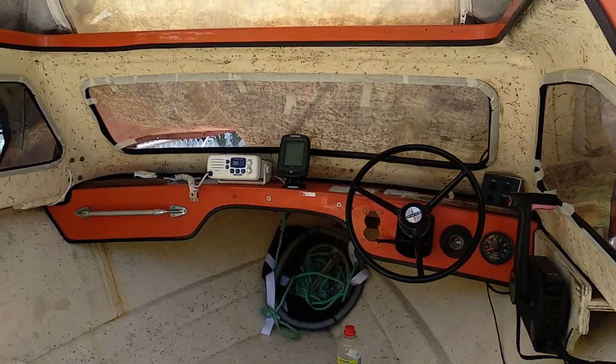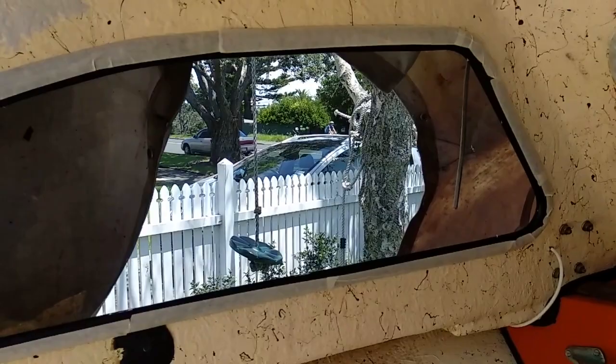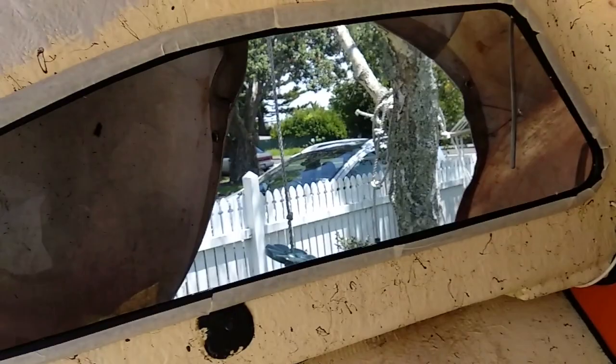It's been reasonably tricky masking these rubber surrounds of the perspex. The rubber feels very non-stick and when you rub it you can just feel how dry and how low purchase there is on it. I've tried some Simple Green — that didn't really work. Definitely having the rubber warm made it even harder for the masking tape to stick, so I've still got to sort this bottom area out. What did work was isopropyl alcohol, which I've been using on a rag.